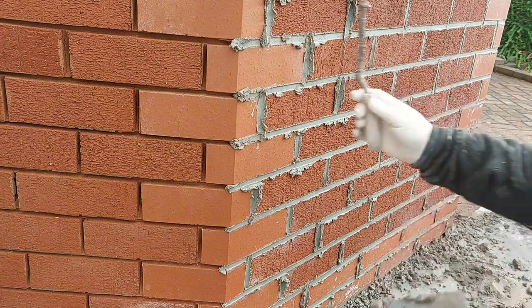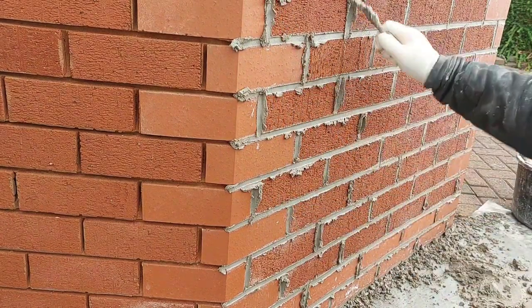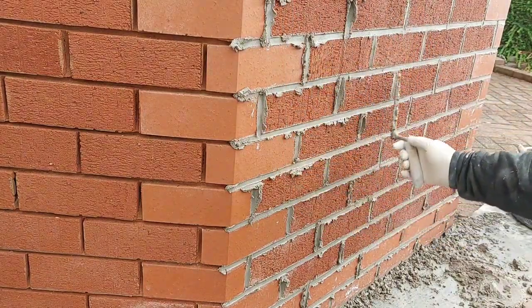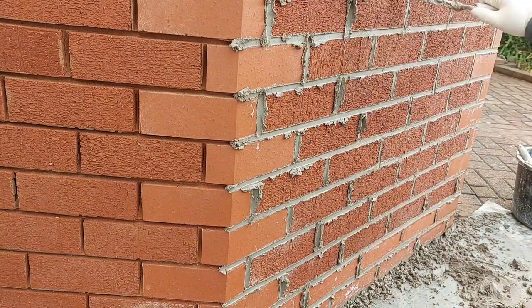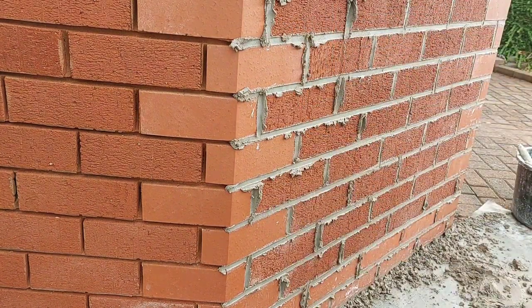So when I've done this quite big, so it can show you when you're putting it in, put it in and leave it, don't mess with it. And do like 1, 2, 3, 1, 2, 3, 1, 2, 3, and then do your beds. Or do your beds first, but only do 3 perps wide, and then you're constantly working in little squares.